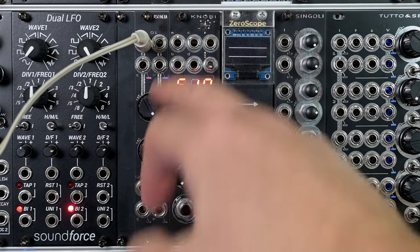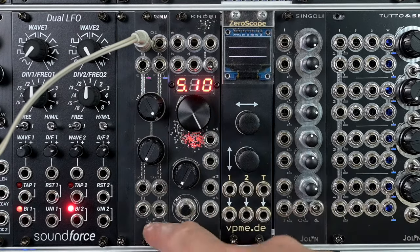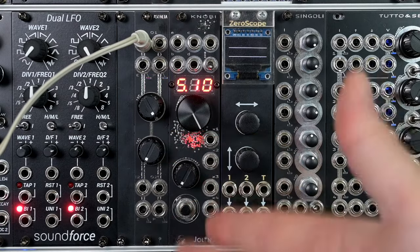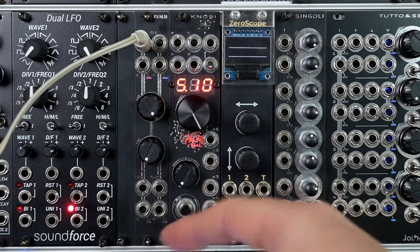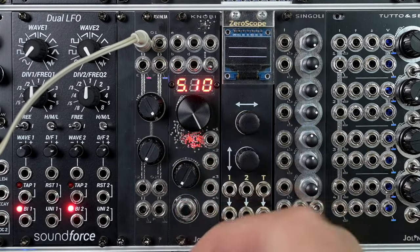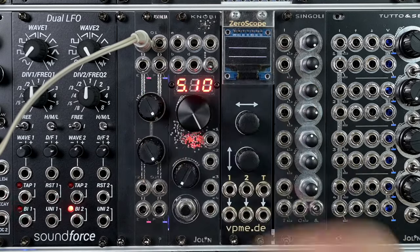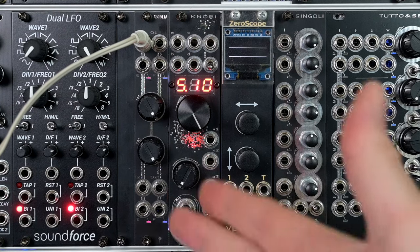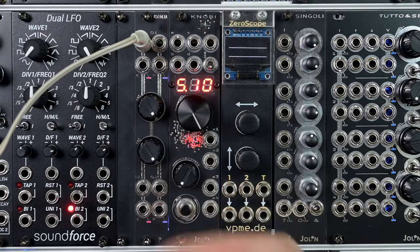But as you can probably see from the LEDs that are flashing here, and here they are not, the amplification setting for both of these channels, even though they come into ASCOLTA at the same place, the settings for these two sides is independent. So you need to set them to the same amount of amplification if you really want to keep your stereo image intact. There's a jumper on the back of ASCOLTA that lets you choose how this second channel behaves.